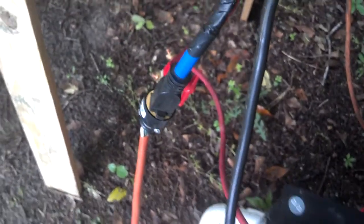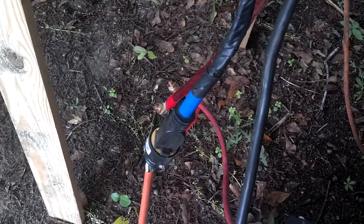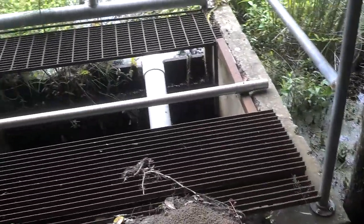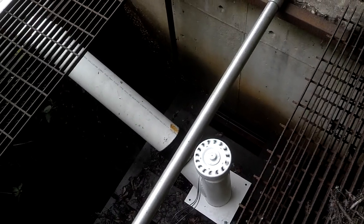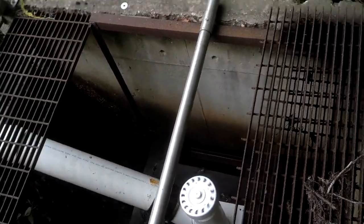Now we're going to disconnect the charge controller and hook it to my inverter — it'll put out more wattage at a higher voltage. In my next video I'm going to hook it up to a 24-volt system, which is a little more efficient. This low-head hydro here is a really high voltage unit. I've got some that are higher amperage that'll work better with more amperage at lower voltages. This one is mainly for high volts.